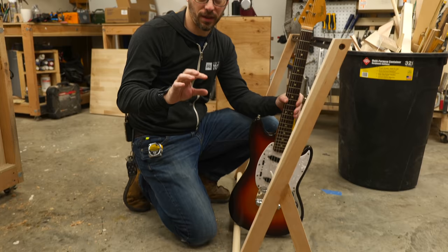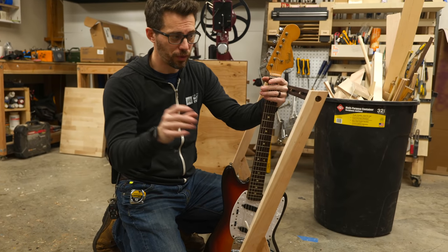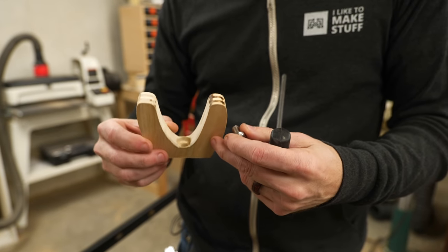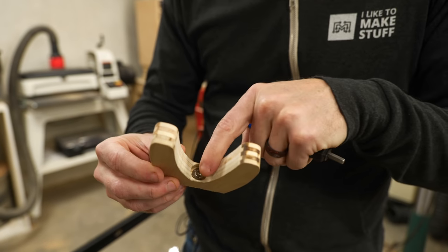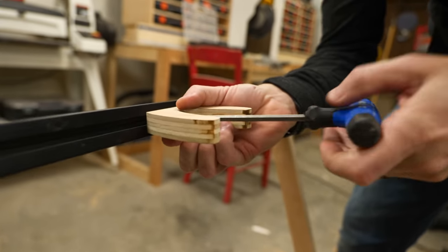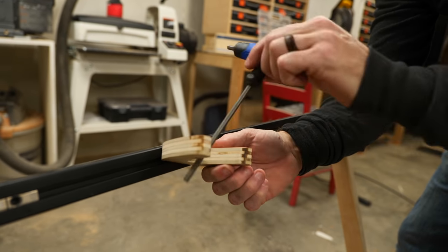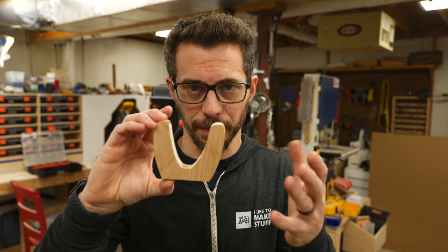That lifts it up off the ground just enough — it's a perfect amount. So the next thing is to make the hangers that are going to go up here and actually capture the guitars. I'm going to make some little U's out of wood and then just drive some screws into these nuts that are captive in here. I've put together a quick prototype — it's a little U that will capture the neck of the guitar and has a recessed hole in here so that the screw can sit down and won't come in contact with the neck. Then this whole piece just gets screwed into one of these nuts. If you tighten that down really well it's nice and sturdy, but it's also super easy to loosen, slide, and you can even change the angle to account for the angle of the neck if you need to.